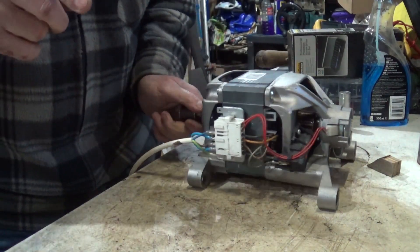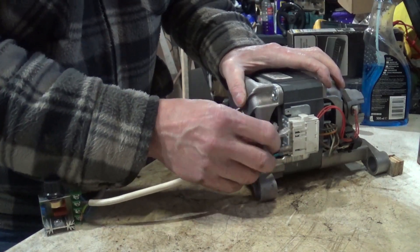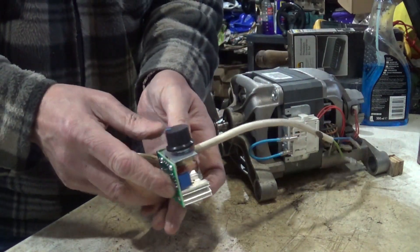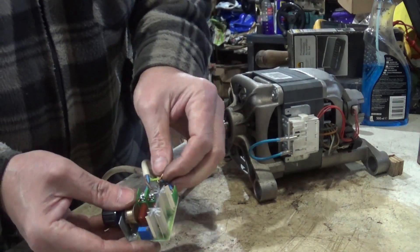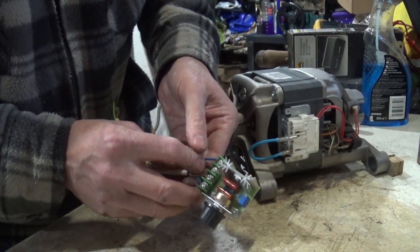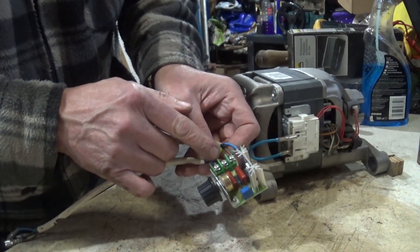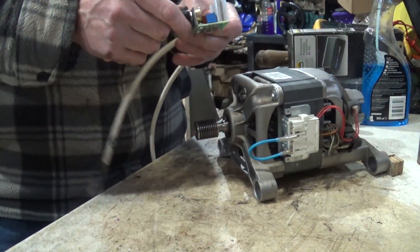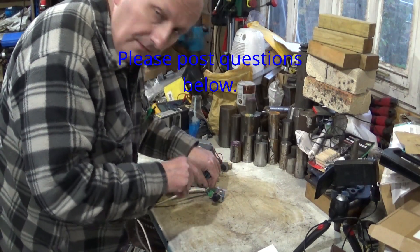So I hope that helps — to the subscriber who wanted a bit more clarity. Going back: we are connecting mains, so if you are going to use one of these, you do want to put this in an insulated box. This is only for demonstration purposes. And on these — I really should put some heat shrink on that, that's dangerous. So on this speed controller, you can see live and neutral are marked, which way round they are, but this will vary depending on the circuit board you use. Hope that helps. Please like, share, subscribe, and thank you very much for watching.